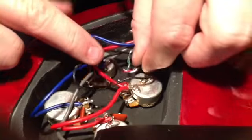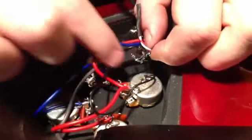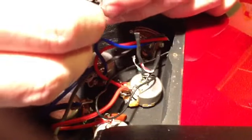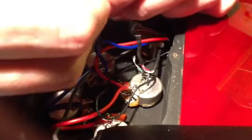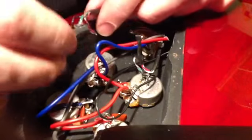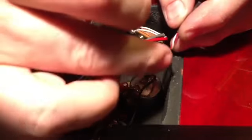That black wire — trying to keep my mitts out of the way so you can see — that black wire gets soldered there. Green wire, ground, will go on the ground. And this one will work the same way. Black is hot. These things look like they're a mess because they've been in and out of guitars I don't know how many times. Should really clean them up, but I'm getting short on wire so I'll make do. So here's ground, there's hot. Here's hot, and here's ground.